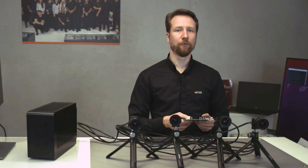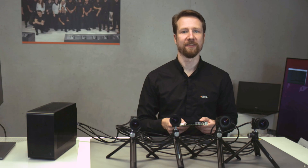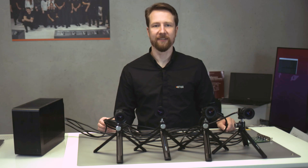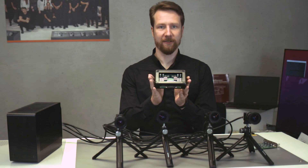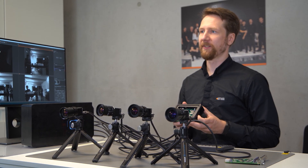But now let's go beyond the standard. This adapter card uses four PCI Express lanes but would block my full 16-lane PCI Express slot. Since I only have that one slot, I could never connect more than eight cameras to the system. Also, as you saw in the last video, you can connect cameras directly to PCI Express, so we don't even need those four USB controllers. All we need is a PCI Express switch that lets us connect multiple cameras to our one PCI Express slot. So we built just that. This is the X switch — and the X switch is not just this one device, it's a much bigger idea. It's a concept that can be custom fitted to meet your requirements.